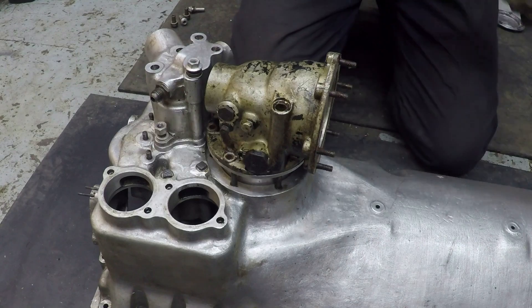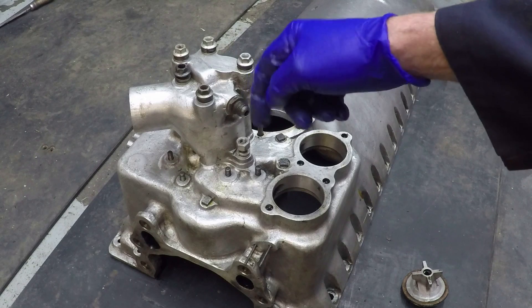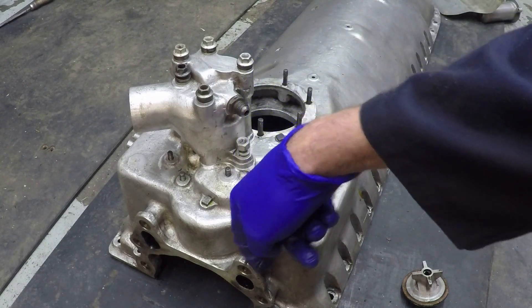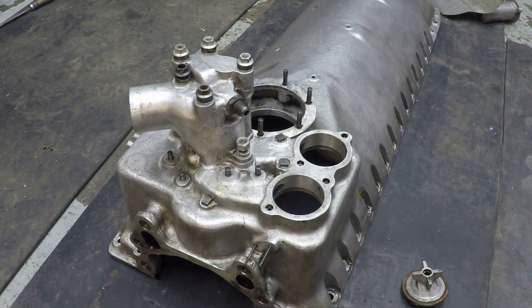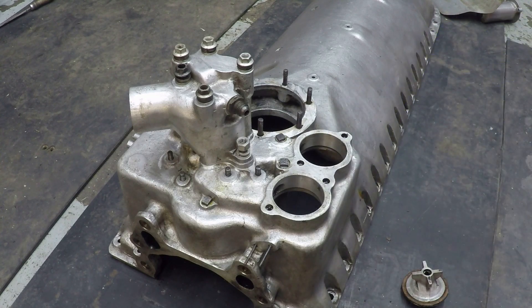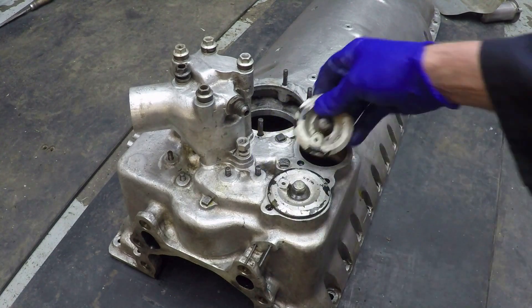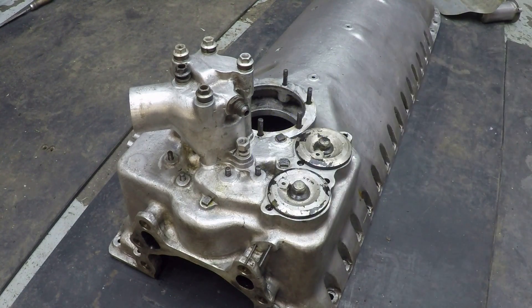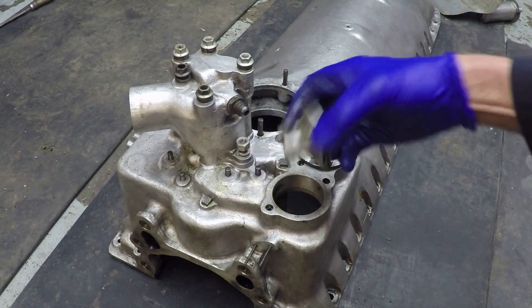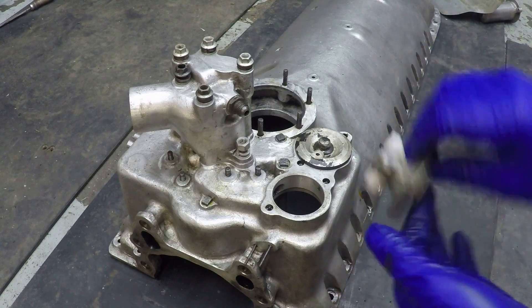This additional fitting on the side of the pressure pump feeds high pressure oil around here, down through a clip, and it actually goes to the fuel pump on the engine. Then once the filter casings have been installed inside the sump — these are the caps — when the engine's on the aircraft you unscrew it, withdraw that, and the filter comes out.